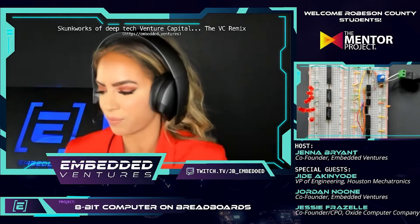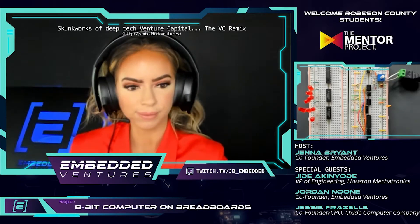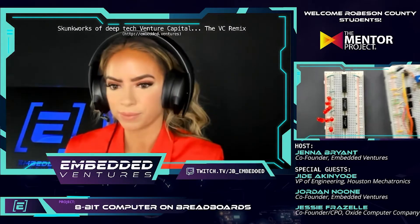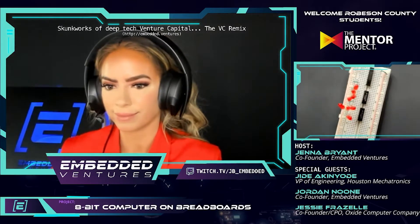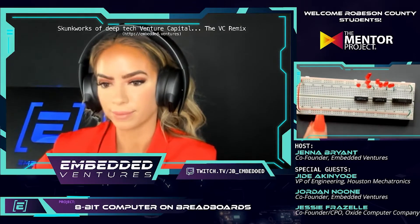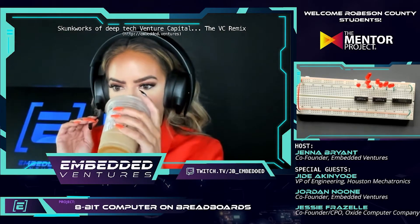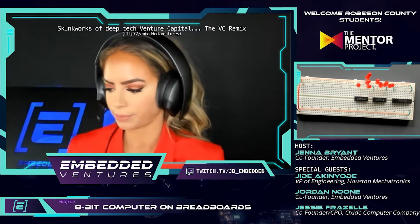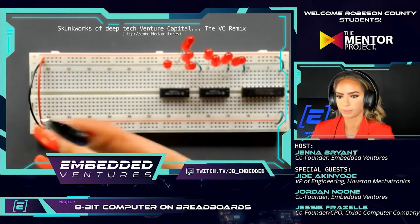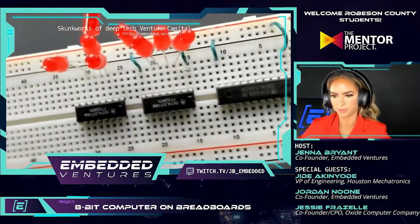What we did last week was we set up the positioning of our 8-bit register, the bus, and the two 4-bit registers which will feed into the bus, which then goes into this larger bus as an array. We'll have three of these actual boards set up like this and we're just doing the first one. We also placed the LEDs — LEDs show whether each bit is on or off, like a zero or one. We've been hooking up the individual chips to power and ground and we'll continue that today, hopefully starting to connect some other stuff as well.